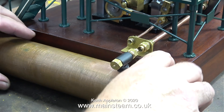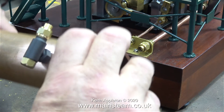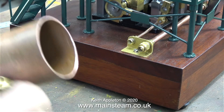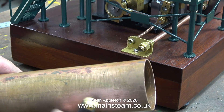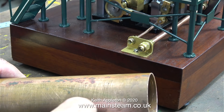In this clip I'm screwing in a check valve. Not that I need a check valve — in fact I'm going to take the ball out of it — but check valves are very useful if you need to add another exhaust inlet to the condenser at any future time. All you have to do then is remove the nut on the end of the check valve and fit a double union to take another pipe inlet.